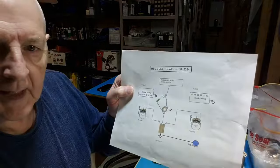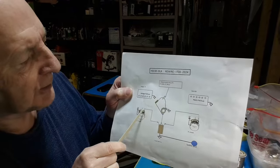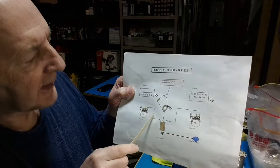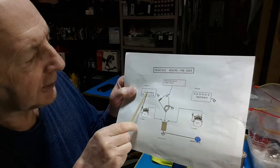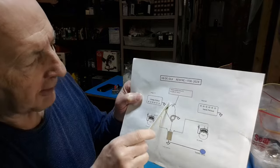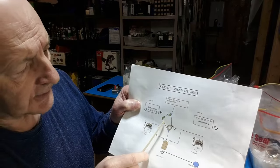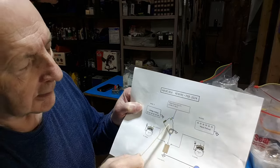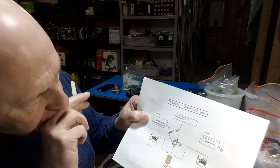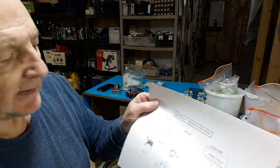This original circuit that I told you I was going to build, that doesn't work. Right, that doesn't work as a bleed like you would have it over here, because a bleed circuit goes across the pot, across the line that's going out, right? So it acts with this resistor in parallel with those capacitor and resistor. This actually acts as a treble killer when you go between the hot and the ground, and I'll show you why. So that's not what I did. What it ended up like is like that.